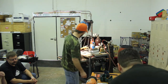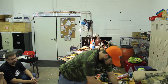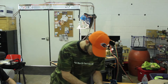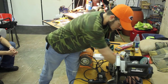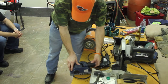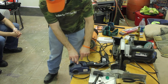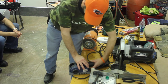The instruction manual is with it. It's a little particular, but basically you stick the tip in, you tighten this thing down. It's like a chuck, just like on a drill. You follow the directions to put it in at a certain exact angle. There's little markings on it. You put it in at just the right amount. When you close these little grabbers here a bit, you turn it until they're flush with the straight edges of this metal, and that adjusts the bit to just the precise angle, then you tighten it down.